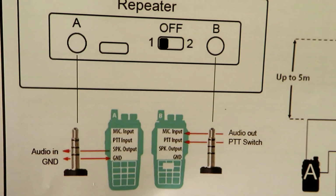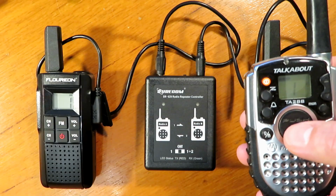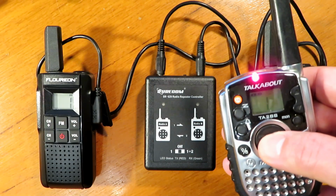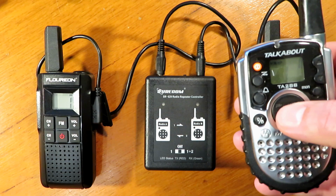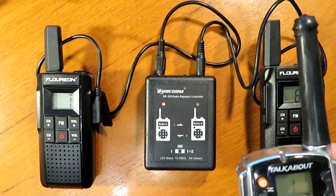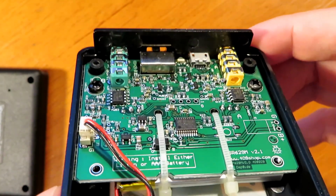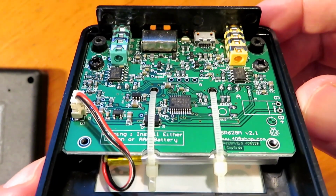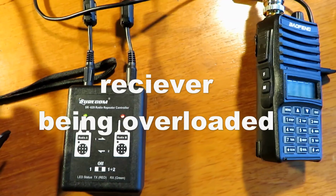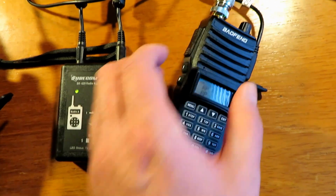If you've followed my channel for some time, you might have seen it in the past. I've tried to use a repeater controller to control two radios to operate crossband as a repeater. I will link to the videos below if you haven't seen it. On paper this should be a simple task, but this just wasn't the case. Keeping separation between the two radios and RF pickup on the leads was just too much hassle to even bother with in the end, where the transmitted audio was so bad that it dawned on me that a much more simple approach like a Parrot repeater would be the way to go.